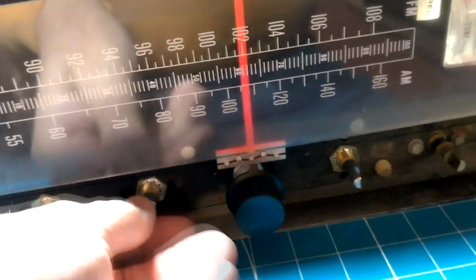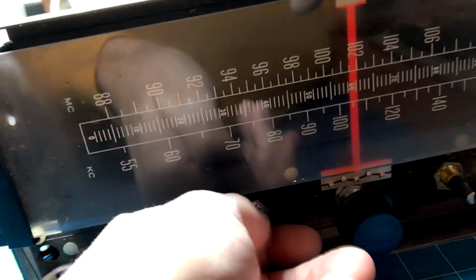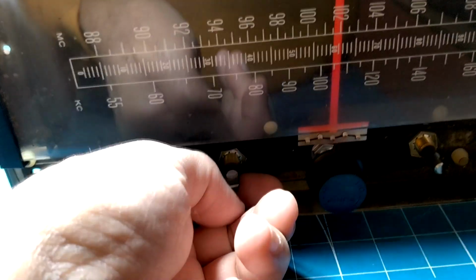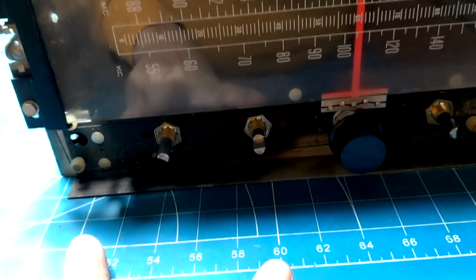And normally you would fix that with balance. But I'm not finding a balance, unless this is a balance, but I don't think so, because if it was a balance that just wasn't working on one side, it would be real scratchy on the other side, or it wouldn't play on the other side. One channel would play and one channel wouldn't if the balance control was bad, or it'd be scratchy, like I say, intermittent. But that's not the case. This is controlling smoothly, both channels are playing.